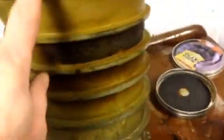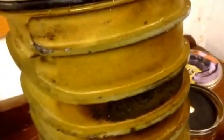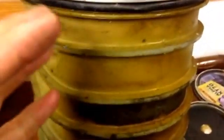So there's someone who spent 600 quid down the drain, and I'm glad it wasn't me. But you can see now from this where your problem's going to be. You can see how easy it would be once you've cleared that bit there, because as soon as you've got the muck out into a wider channel, it's going to flow. Once you've got it down from here, there's very little chance of it getting stuck again, so you can blow it down and round and out the bottom of the boiler.